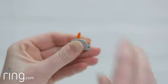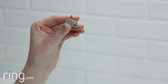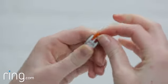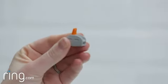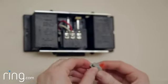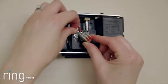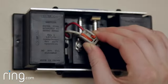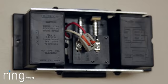To open the wire clip, lift the orange levers all the way up. You will feel like you're going to break them. The connector is open when the orange lever is at a 90 degree angle. Insert the wire you just removed from your doorbell into the open hole in the connector. Then snap the orange lever down to secure the wire in the connector.